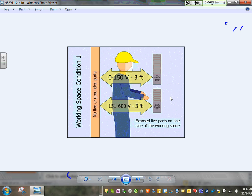We talked about the panels and the overcurrent protection device ahead of them and the feeders and what's not. We talked about the clearances in the front of the panels and dedicated working space and dedicated space. So important, the width and the depth and the height for the working space as well as the dedicated. Working space for people, dedicated space for equipment. Equipment means pipe coming at the top of the equipment. Any comments, Brian?